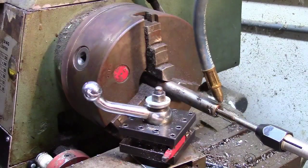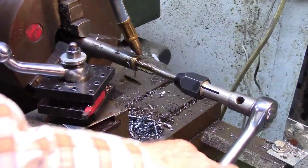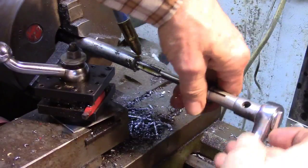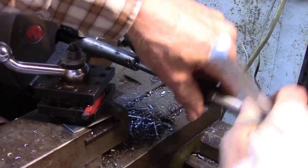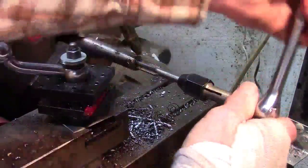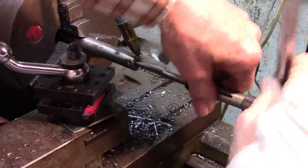I'll turn our oil on here. Of course I could go faster if I had two hands, but I don't. It would be real nice if I had two of these things so I wouldn't have to be changing it back and forth. Now we run in our second tap. You get to the point where you're putting almost all the pressure you can without breaking it, and when you get to that point, back it out. Then back to the other one — same thing, back and forth with our starting one.